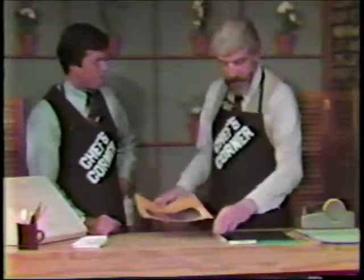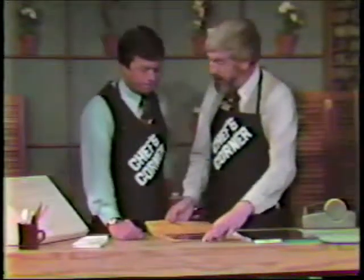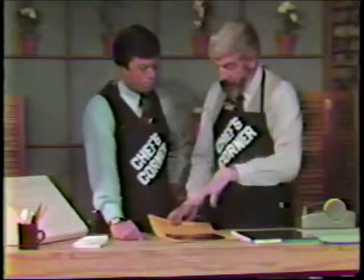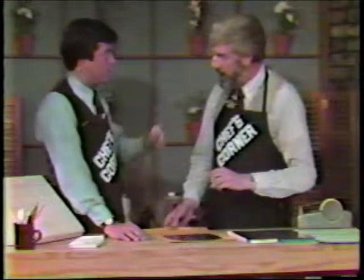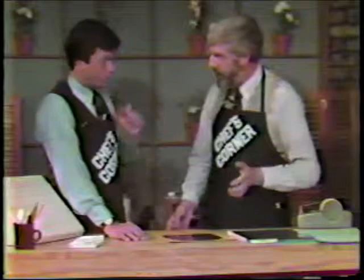Then the next step is to desensitize it in lacquer. Remember, this is the fun part. It is a light-sensitive surface, and the exposure lamp is going to go through here only in the image areas. So the non-image area is still going to be sensitive to light. So we have to desensitize it, and we have a solution that does that.